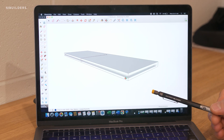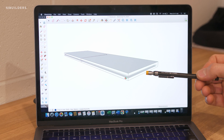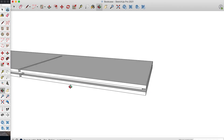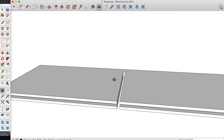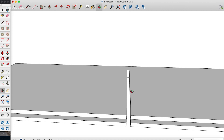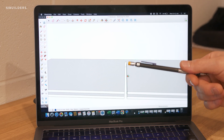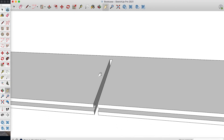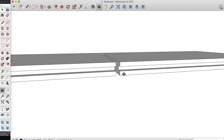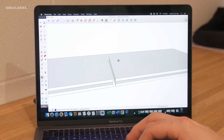We could do this after assembly with a series of dado cuts or rabbiting bits, but that's a lot of work and creates a lot of unnecessary dust. So I'm going to size these pieces a little bit smaller so we can fit them right around those cleats without interference. I'm also adding a little bit of extra depth, which will allow me to square the shelf up later without compromising the depth of that pocket for the cleat. The same cleat runs across the back as well as the other side, and the middle section is what's going to slip right over that vertical support.